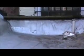Okay, the other issue with this is that there's this kind of a wall right here that would have to be, the top of this wall has to be taken off because the bottom of that window is lower than the top of that wall. And so we don't end up with a swimming pool around that skylight, the top of that wall would have to come off so that it can make a smooth transition. Okay.